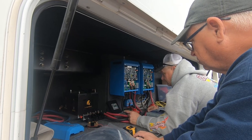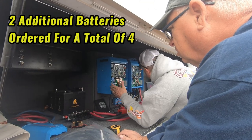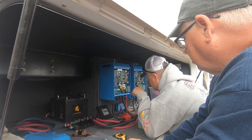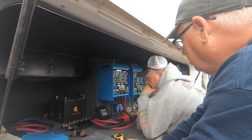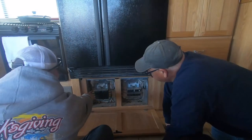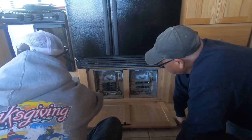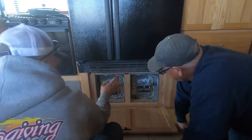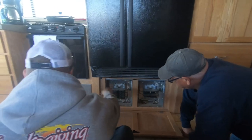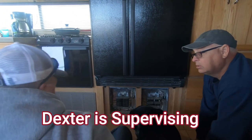Okay. All right. So we've got coming in, switch, good. Battery there, that'll heat these up. Now we also have to get your coach battery cables in here somehow to eliminate those front batteries, you know what I mean? Right. We have this off one of your inverters, this off the other inverter, the new ones. And then this wire going to your old inverter and coming back, we'll just eliminate and leave it back there. Let me pull these two out so we can get to that transfer switch, because we need to run from there down to your new inverters and then back to here. We might get lucky and be able to use some of that wire maybe.